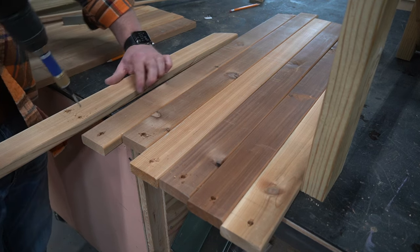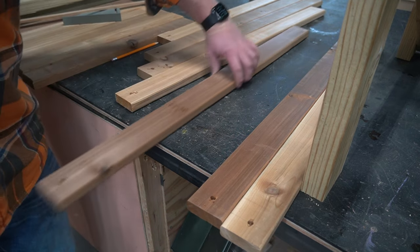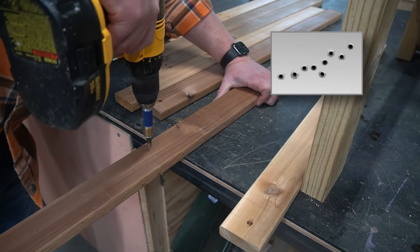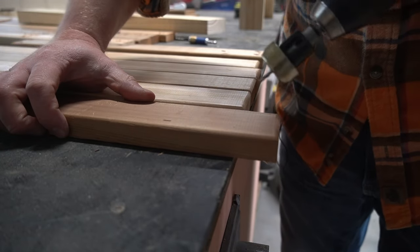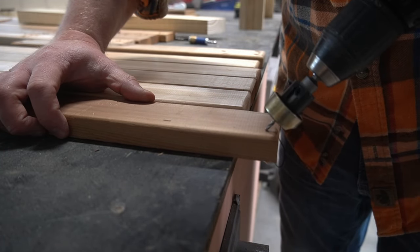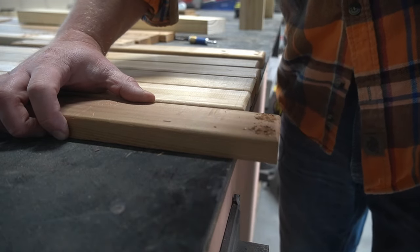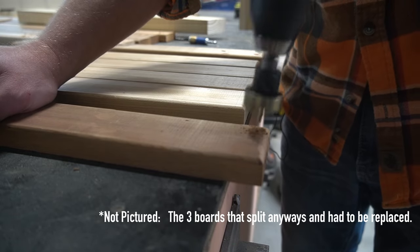Take your time and draw straight lines across the back, then pre-drill countersink holes to make sure they all line up and don't look like a cartoon tommy gun drive-by. Go ahead and do the same thing for both sides of the seat slats — it'll look better and also help prevent the wood from splitting when you put the screws in. Most of the time.